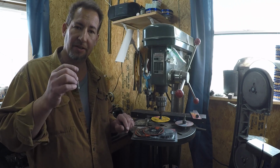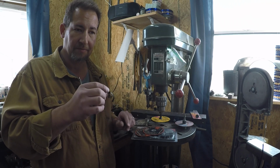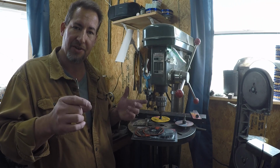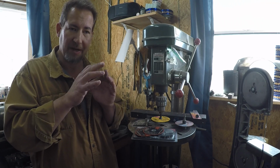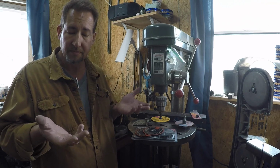If you cut in your nail nick after heat treat and after you've got the whole knife set up, then you can say, okay, now everything's working. The three positions in the knife are working great. Everything's where I need it to be. Now this is where I want my nail nick. Now you can cut it in after heat treat. That's a really good way to do it.